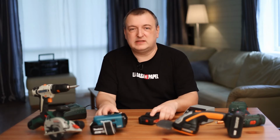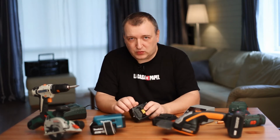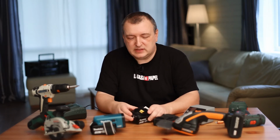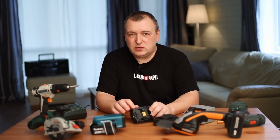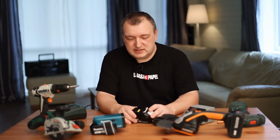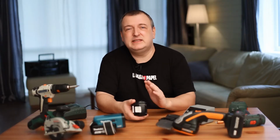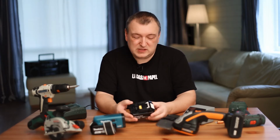If the battery is a completely new modification, then a CAN balancing board can be installed inside it. This is a BMS controller that balances your battery on its own. But the charger does not take any part in this process. Well, as I said, most modern batteries do not even have such a BMS board. There is only a protection controller. When a battery is assembled at the factory, it must use cans of the same capacity and production date. Therefore, theoretically, for such cans, a balancing board is not needed.